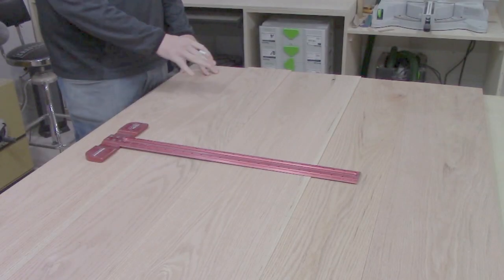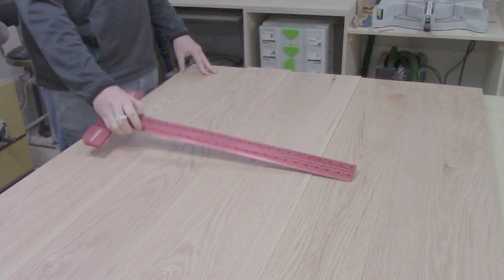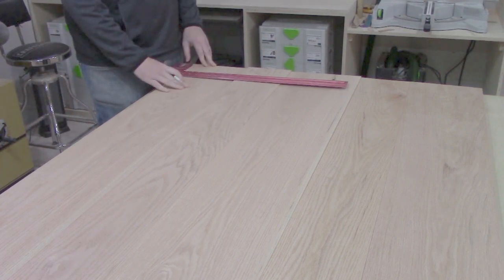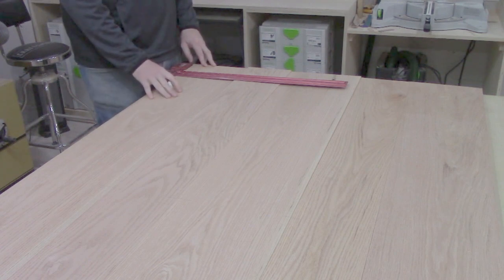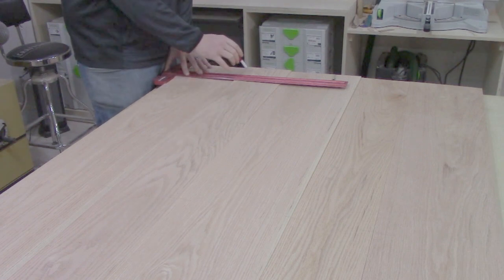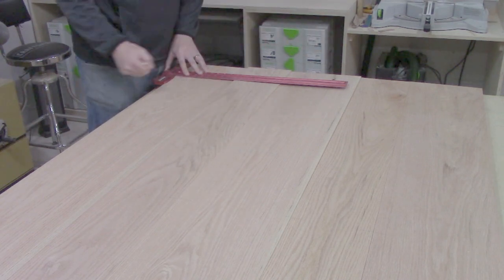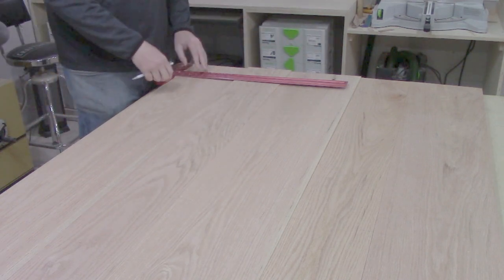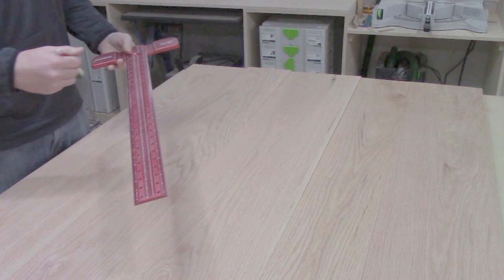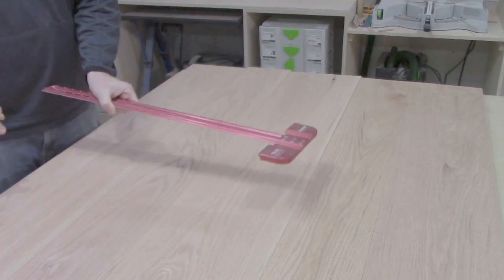I already have my markings where I'm going to put my dominoes, but the process is fairly simple. I just take my T-square, put it up against the edge, and run it in the same location however many dominoes I want to use. In this case the board is 72 inches long and I'm only going to use five, but it'll be five on each board. I just stick the T-square here, mark the spot that I want, go to the next seam, mark the spot, go all the way down, and then flip over to the other side. If you had a longer T-square, you could do all the way across in one go, but I just do two on one side, flip it around, and do the other side.